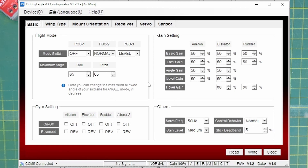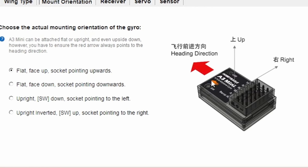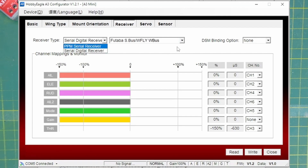There is an awful lot to go through on these screens, but that is not the purpose of this video — this is just an introduction. We have tabs along the top to select our wing type: flying wing, V-tail, or standard. The orientation sets how you mount the gyro in the model — the heading direction is always the red arrow on the unit, however you can put it face up, down, left, or right and select the correct mode. Receiver type is selected here; one of the advantages of the A3 Mini is the multiplicity of protocols it supports. You can also connect via PPM. In here we can see channel mappings and change channel assignments as needed.